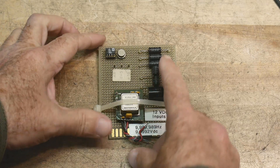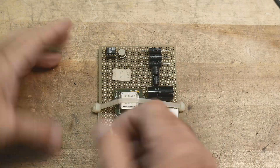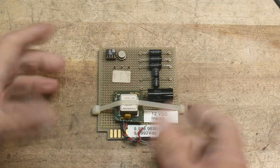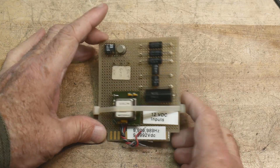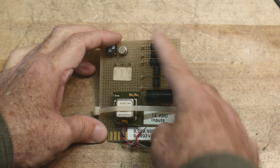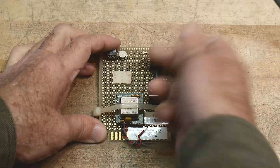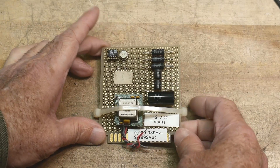If you can just find individual resistors, sometimes you don't need to set them with a knob — you can just move your clip leads and there's your knob. If you find a bunch of nice resistors and put them on a board, you can go clip, clip, clip and that works just fine. These are 0.01 percent resistors, really really nice. Even just one-percenters in all the different values might be good enough, and you can do that super cheap.